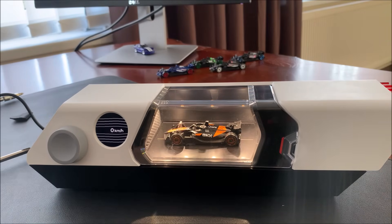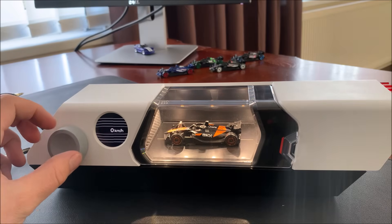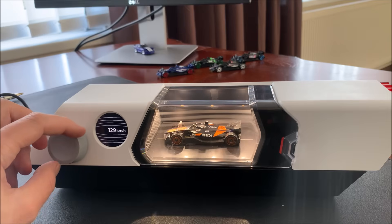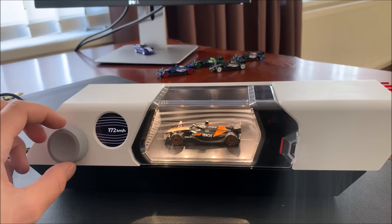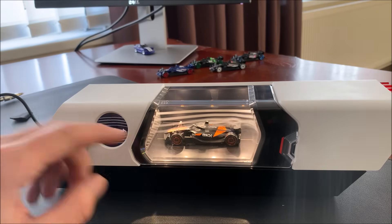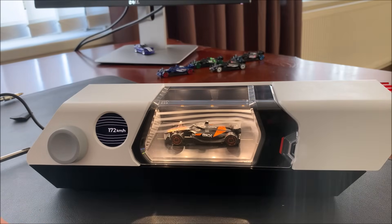And of course at last you're all keen to see what the Formula One car does in here. So let's check out the McLaren aerodynamics, just for fun. We can see big separations from the halo and big separations from the TV camera — there's a lot of room for improvement. The rear wing is completely in the separation bubble, so it doesn't really do a thing.